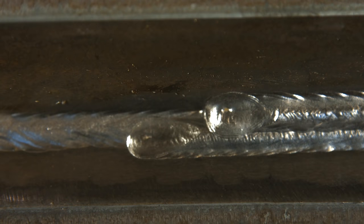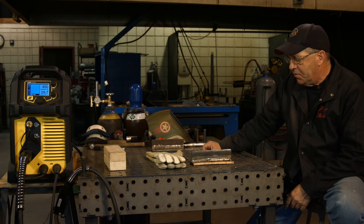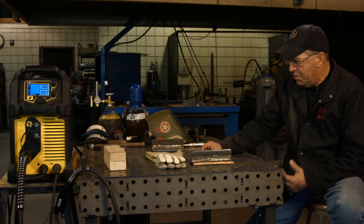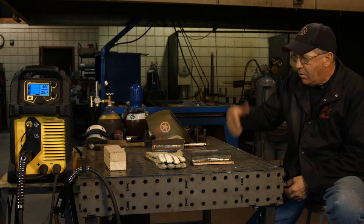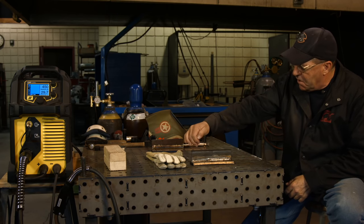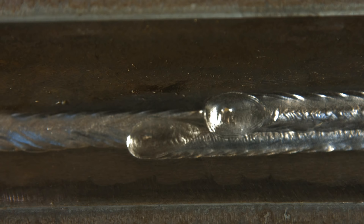Welcome back. Let's recap on everything we did today. We started out and did an S-MIG .045 wire with 95/5 gas, pulled the trigger and did a fillet weld. It reacted kind of like we thought — it was kind of soft, you could tell it had the heavy argon to it. It welded okay. We went ahead and switched up into spray mode and ran 27 to 27.5 volts and 390 to 400 range on our wire feed speed. We did the single spray pass in the center and stacked two more just to show a little buildup. Could we have gone higher? Sure.